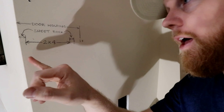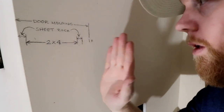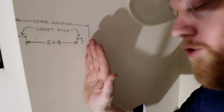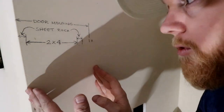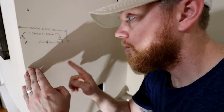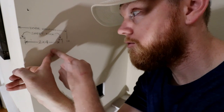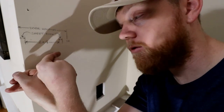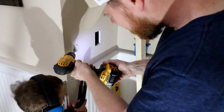Right here on the corner of the wall I've marked the stack — you've got a piece of 3/8 sheetrock, a 2x4, another piece of 3/8 sheetrock, and the door molding. I believe I can use a paddle bit and drill in at a really sharp angle so it comes through this 2x4, and I can still put my sheetrock on and then my door molding without any issues.